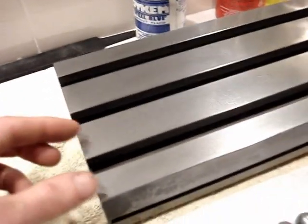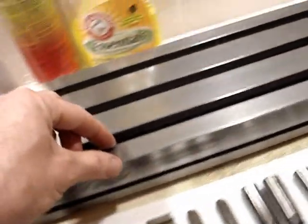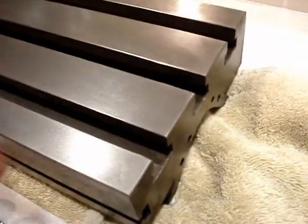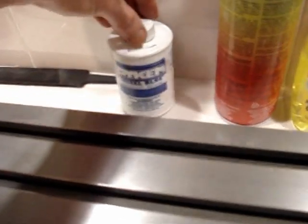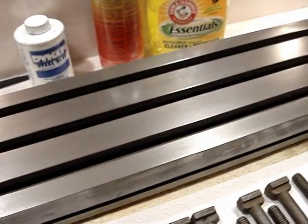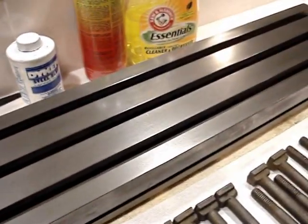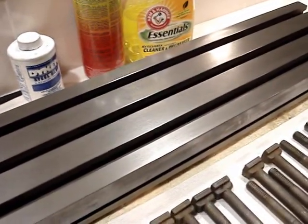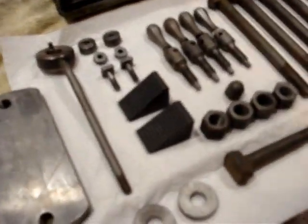There's not that sharp edge that gets dinged, so that came out real nice. It took about 45 minutes with a metal file just to do it by hand, and there's some steel blue from the file over there. I chamfered all the top edges — it's super minor, like five thousandths or something — so it shouldn't affect anything on using the mill, but it does give a little added protection to the edge.